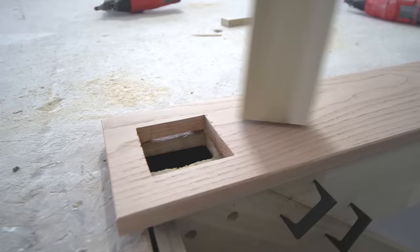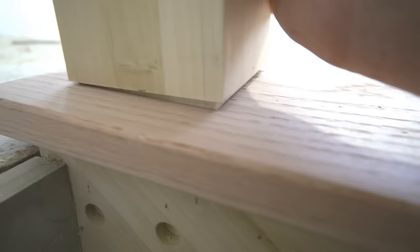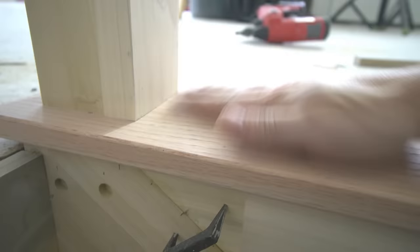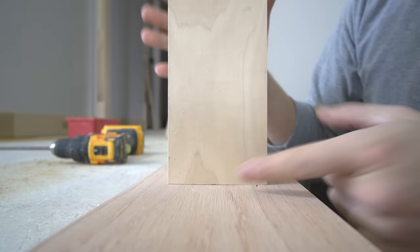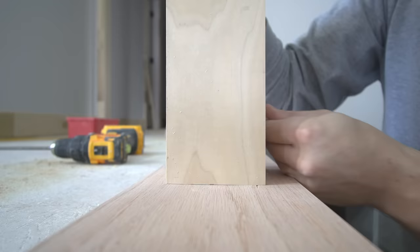What this allows you to do is drop the post down and it looks perfect all the way around because of that rabbet. Essentially we're creating a little bit of a cope joint here — just a pass-through joint — but it gives the appearance that this post is sitting flat and cut off flat on here, even though it's not. Having that notched out and dropped into the framing allows us to screw through here into that post so the post will not come loose. On the center post we've got that exact same thing: it drops right in there and looks perfect. It's just a simple pass-through illusion — it makes it look really nice.